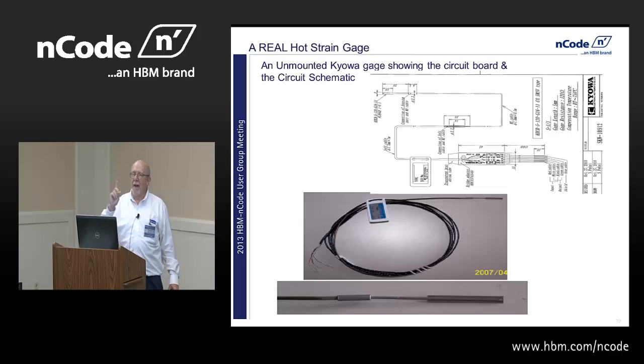And a very important thing that's on the big Vishay poster that any of you can order, they say a shunt cal does not mean you know what this calibration is. Hang dead weights or a load cell to get your calibrations, okay? To know I'm putting in 78 newton meters when I hang this weight, and that equals 75 microstrain. Whatever you need, that's what you've got to do with a dead weight cal. Shunt cal just gets you balanced so that you're at a zero point.